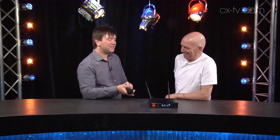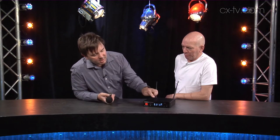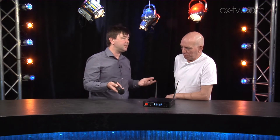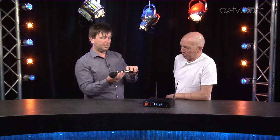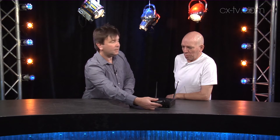You can do a scan like most wireless systems now. There's a handy scan function on the front — you just hold it down, it goes into scan mode, it'll check for available frequencies and find the best one. Once it's found one, you open up this compartment and hold it in front of an infrared receiver, and it assigns the channel to your microphone. That's almost foolproof.